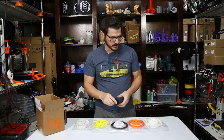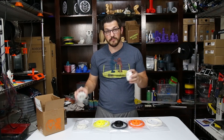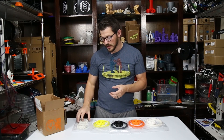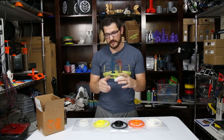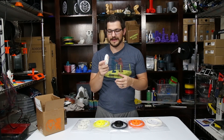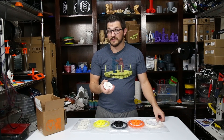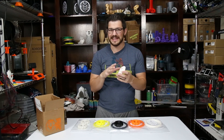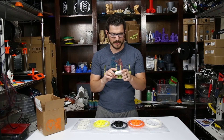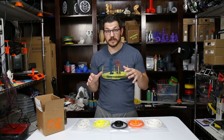The Mondo Box prints came out pretty good — I got good results out of most all of them. I did have some issues with the CC Tree glow-in-the-dark and the IC3D white; I had under-extrusions in both of them. I caught the under-extrusion in the glow-in-the-dark during the print and was able to reprint, getting a beautiful print with very little filament left. With the IC3D, I let it complete overnight, came back in the morning, saw the under-extrusion, and decided I didn't have enough filament left to reprint.